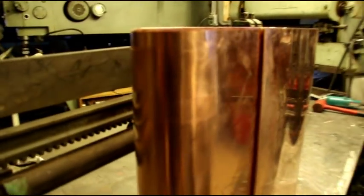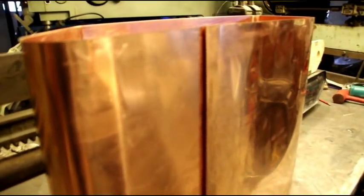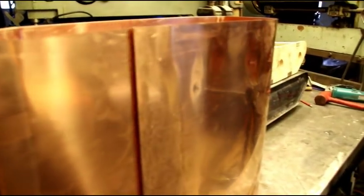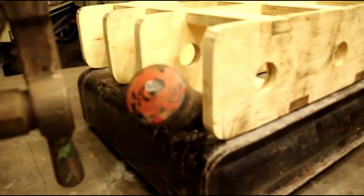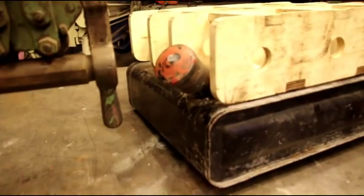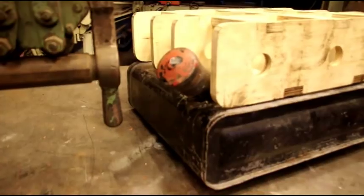We've got to crisp up some of these bends, put the buck back in it, and make some adjustments. I've got the two bends in it and that'll make our seam. We'll get working on the center part that goes in there, make some cutaways for fuel to slide back and forth, then get working on our end panels. We'll put those on the power hammer and raise them up real nice, run it around the flanger to put a nice detail in there, and I've got the cap and filler neck ready to go. We're making some progress on this.